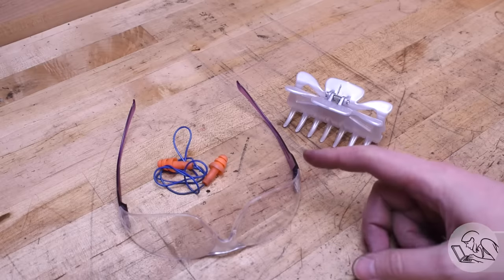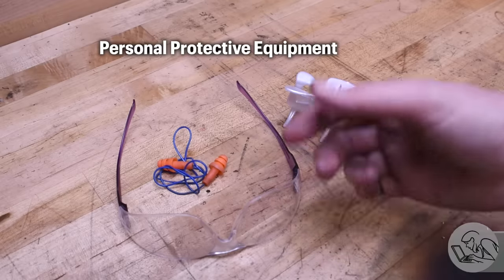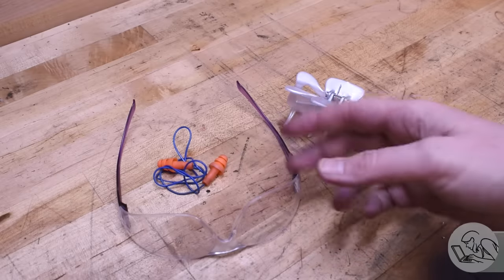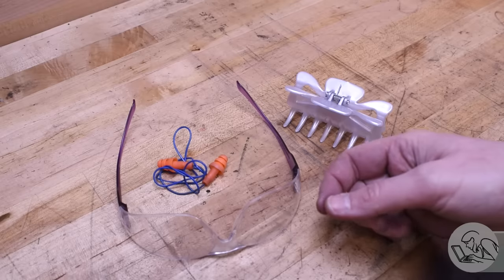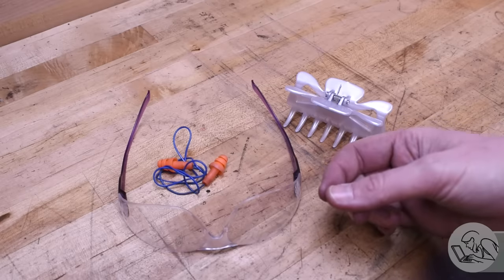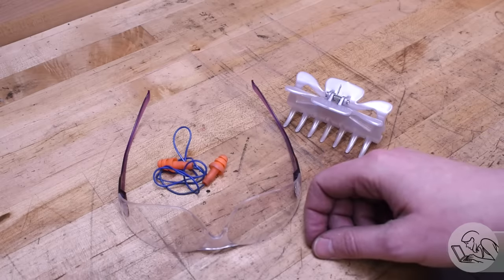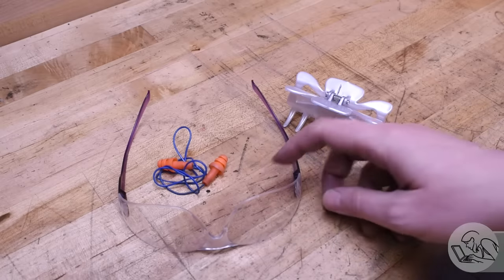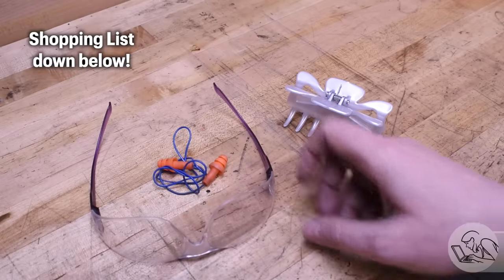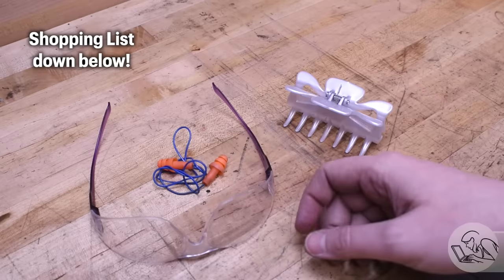Before we talk about anything else, the top of your shopping list has to be PPE. If you're coming from other hobbies like 3D printing or basic DIY stuff, you may not appreciate that machine tools are quite a bit more dangerous than other things you might be used to. Now if you've used table saws or angle grinders, those are murder machines and so you're comfortable with that already. But you've got to have some basic PPE in the machine shop. Top of the list of course is safety glasses. Don't even set foot in a shop without those on your face. It's non-negotiable - safety glasses all the time.